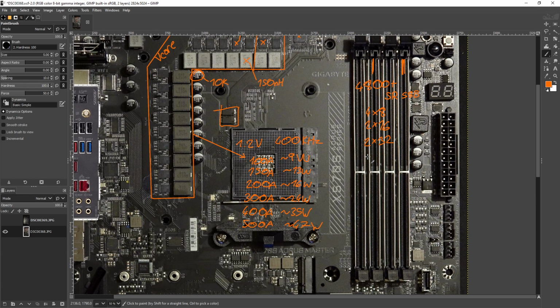Now, I'm not sure that right now it is absolutely the best daisy chain available on X570, because MSI is coming out with a new daisy chain topology, ASRock has a new daisy chain that I haven't gotten around to testing, and, well, we don't have to worry about Asus, because as far as I can tell, Asus has been using the same memory topology since the launch of X570, and it sucks. Incidentally, the original Gigabyte X570 topology is basically the same as the original Asus X570 topology. Though Gigabyte was the first manufacturer to change memory topologies.